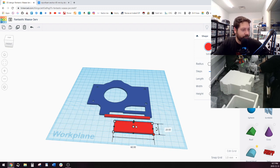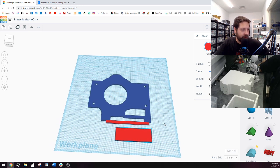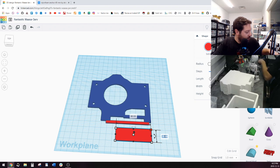Yeah, I definitely make them actually not 100% infill. I make them close, like 95, because I've done 100% infill before, and unfortunately, because of the squish of the print, when using PLA, specifically in my case, it forces the PLA more outward, and you get a really rough exterior to your print. So I try not to go all the way up to 100%. Try to be a little bit beneath it, so my print doesn't get wrecked on the outside, and I have to do a lot less sanding if I need it smooth. An example is the Piv gear printed at 95%, and it was so smooth on the outside, and I didn't have to do any changes at all.